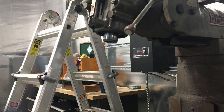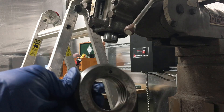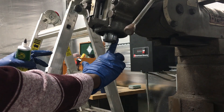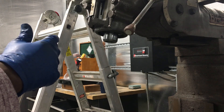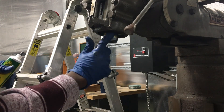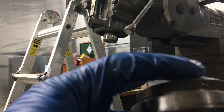That's the final seating of that. I have a little bit more to do in terms of cleanup of this nut and we'll get her finished up. As a little bit of insurance, I'm going to put some extreme pressure lube around just this face here. It shouldn't need it — it shouldn't need anything — but, me being me, it'll just make me feel better and sleep easier at night. I'm going to wipe that down with a Kim wipe and then put the cap on. There's the little set screw here.